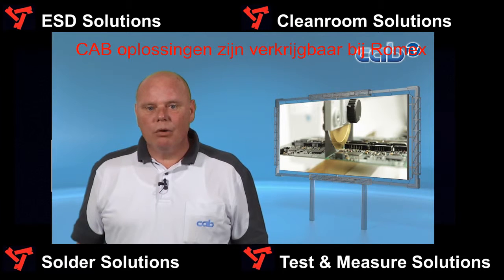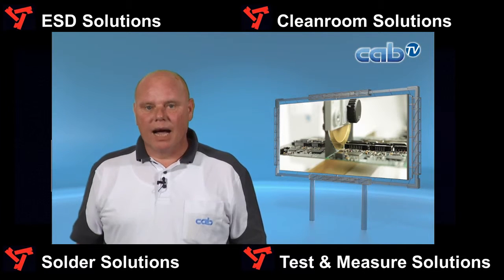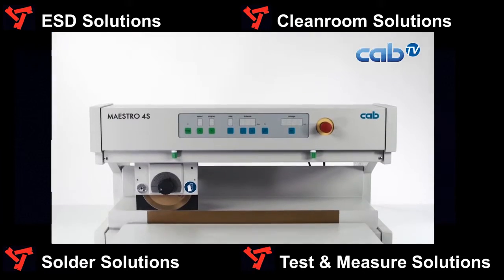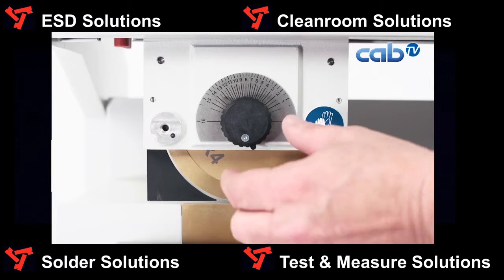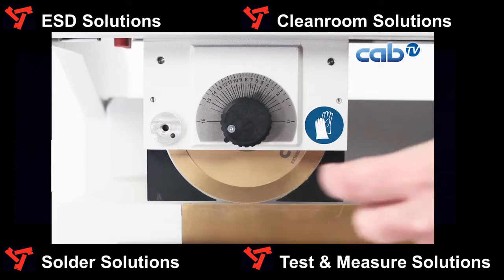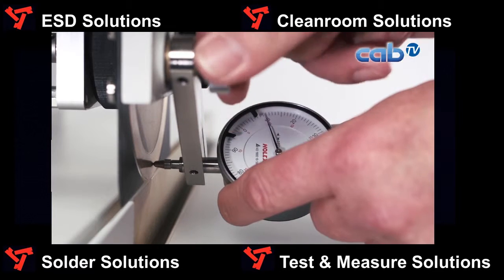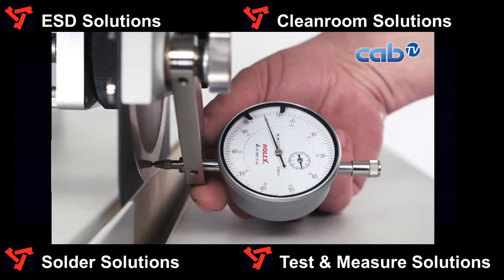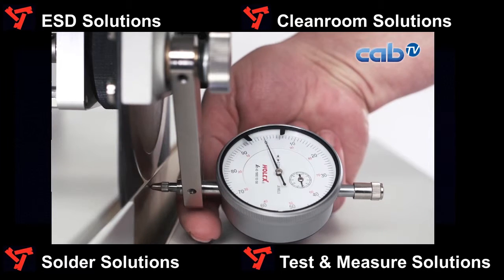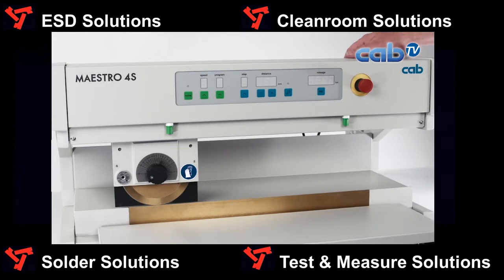What you are watching now is the standard separation of FR4 PCB. It is done with one cut. The gap between the blades is about 0.05 millimeters. The displacement between upper and lower blade may not vary more than 0.1 millimeters. The engine finds its lowest position.